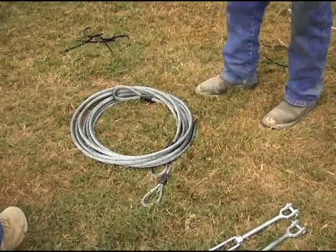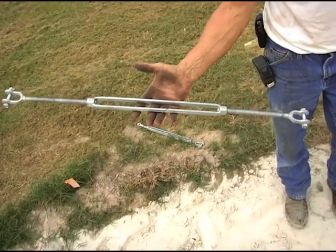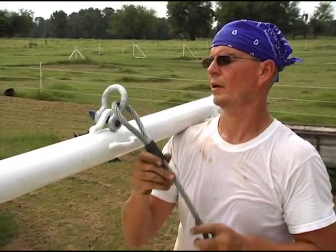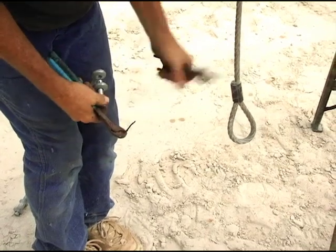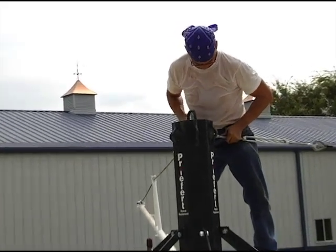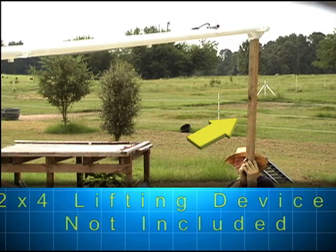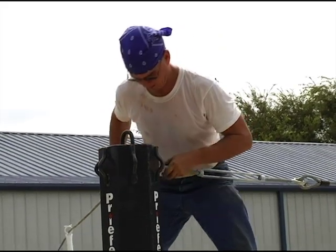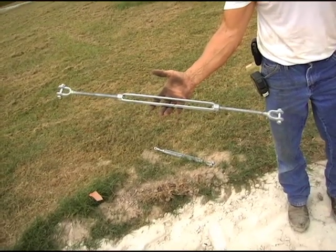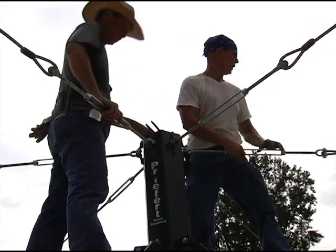It's now time to attach the top cables. Attach the 241½ inch by ½ inch diameter top cables to the outer arm and attach the turnbuckle to the top of the tree. Attach the ½ inch shackle to the cable eye and the top loop at the end of the outer arm. Then bolt one end of the turnbuckle to the other end of the cable, and bolt the other end of the turnbuckle to the loop at the top of the tree. This will require a lifting device to raise the outer end of the arm, which allows enough slack to bolt the turnbuckle to the tree. The turnbuckles need to be unscrewed all the way out until the threads are flush with the nut. Continue to attach top cables until all six arms are complete, then tighten all top cables until there's a slight upward bow in the arm.